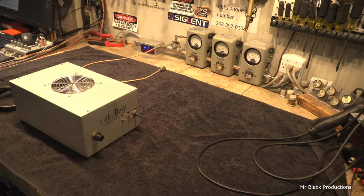I'm doing a huge antenna overhaul this summer. New tower, new beam, and I'm tired of running my amp on low, which is where I've been now for 3 years. I want to see where the thin air is at. I want to turn the box up. Well, for me to do that, I have to start accumulating 1.25 inch fittings and 1.25 inch coupling plates, and first I need to go find the coax.